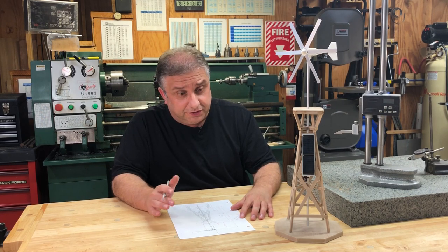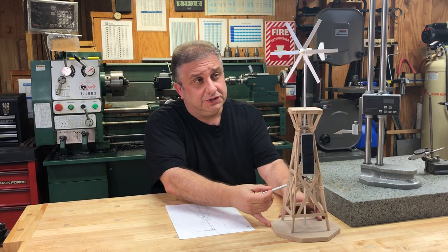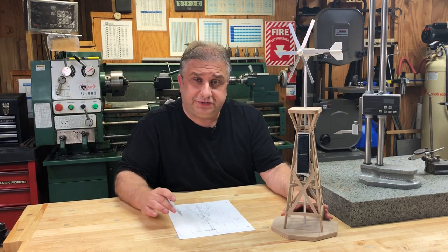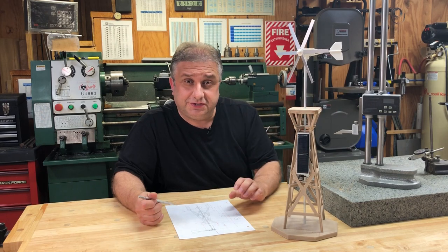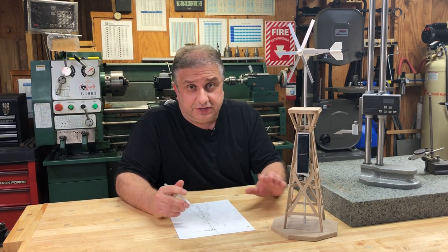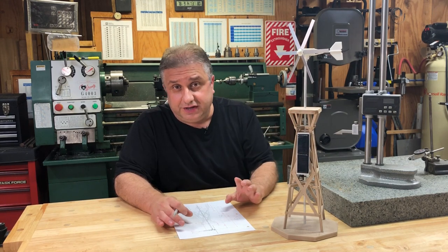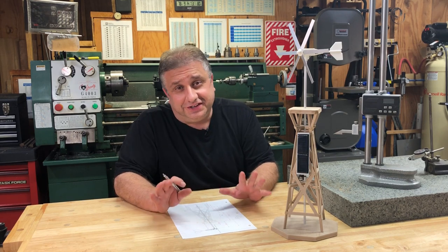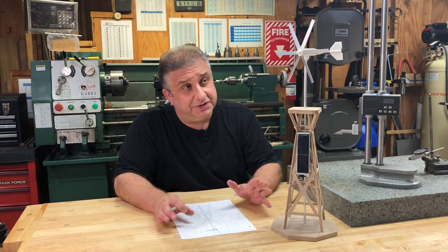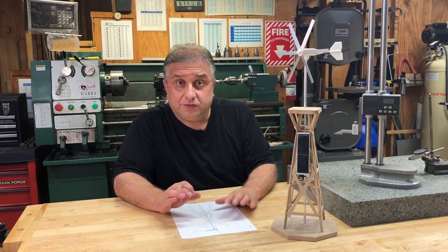So the real wind generator itself is 17 and a half feet tall from the base to the center point of the nose cone. From the ground level to the top of the platform is about 13 feet, and at the top I've got a 4 by 4 section. I came up with this design to support a schedule 40 pipe that holds the actual wind generator head. On paper it looked great, but when I actually built the platform and climbed on top, it was high enough that I wasn't comfortable standing up there. Luckily I had some good friends who weren't afraid of heights and helped me assemble the wind generator. It's been up since 2007, been through some serious storms, and survived no problem.